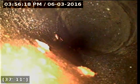And because of that depth, if a repair is done on the homeowner's expense, I highly recommend relocating. When you hit that kind of depth, the locator signal is not quite as accurate. So you should treat that marking out there as a rough marking. Anything below 15 feet, I can't get an exact depth on, which also means I'm probably not dead centered over the top of it as well.